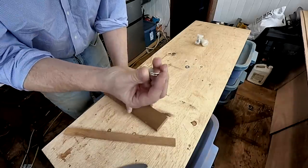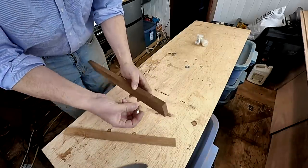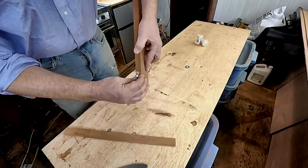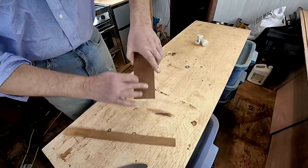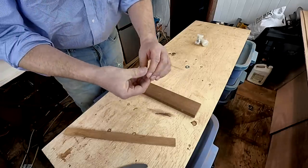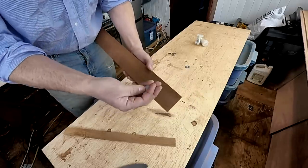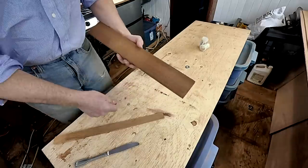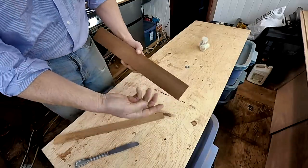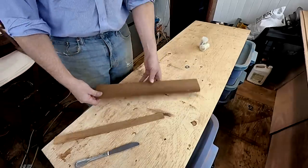If I put them in stacked, let's say in a routed trough, which I'm going to have to do, I get them as close to the face as I dare, leaving just the thinnest little bit of veneer of wood on this side, and I stack two. If we find that it's not strong enough, in time I can take this off the bulkhead and toss another magnet on top, making it even stronger. The first magnet in the trough will be epoxied into the bottom of the trough. The subsequent ones will just snap to it, no doubt. Okay, so that seems to work.